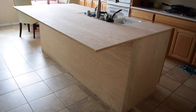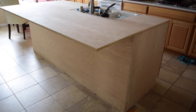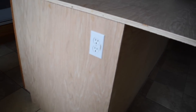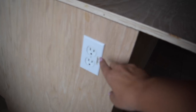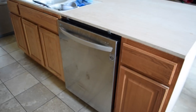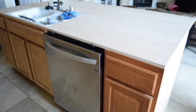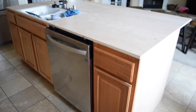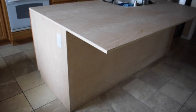We are about a week and a half into this remodel of the kitchen island. My husband has placed plywood on top and we have wrapped all of the sides with plywood. He actually moved an outlet — it was initially in the tall countertop backsplash, so we relocated that and added a cabinet here, which actually extended our island 15 inches, so it's quite a bit bigger now. I'm going to go ahead and start sanding these corners, and we are building a butcher block countertop for this.